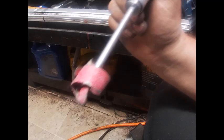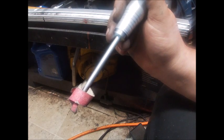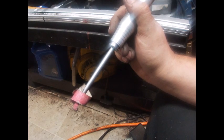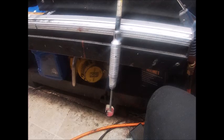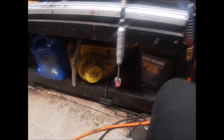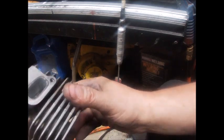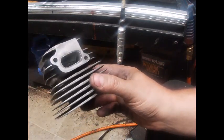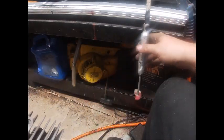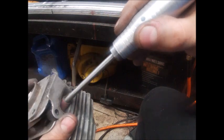What we're going to use here to do the finish work is a quarter inch slotted mandrel. We're going to start with what I think is probably 120 grit paper and work up to a finer paper. I'll usually end with steel wool with a little bit of WD-40 or penetrating lubricant. There's a lot of ways you can do this — you can buy polishing stones — but I really like this method. The higher you run it, or the faster you run it, the better the polish is going to be.